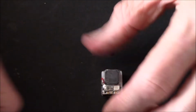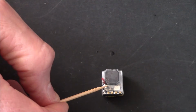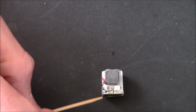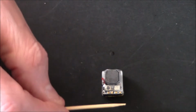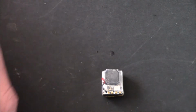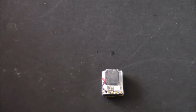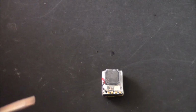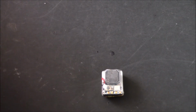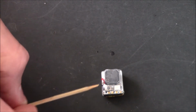Right, but you've probably heard about them before. But this particular one that I'm recommending, it's got a little button on top. You can set if you want it to ring every 30 seconds for an hour, every 20 minutes for 16 million years. It'll come ready to go. If your battery gets ejected, it'll start beeping after 30 seconds, and it'll beep for about an hour or two or whatever. You're going to find your model by then, especially with a 3-inch, because you're going to have a rough idea where it is, it's somewhat small. You're not going to be going long distance. To turn it off, little button on top, you press it 3 times to turn it off.